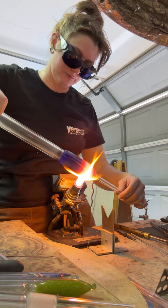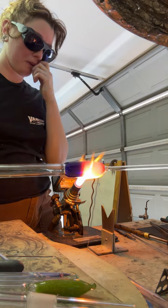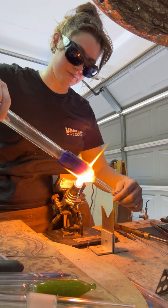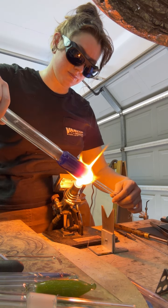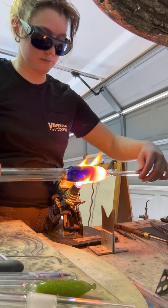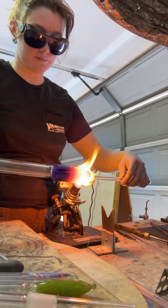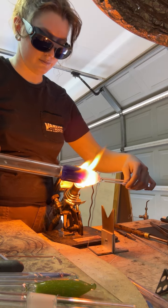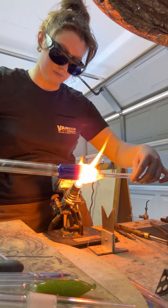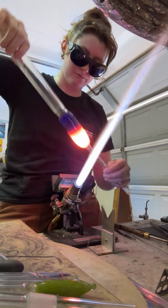I want to make sure that the section that I'm working with isn't going to be a hard 90-degree angle heat break. I want there to be a descending amount of heat into that handle, a decrescendo, if you will, of heat into that handle, because I need that thicker portion of the flare that we initially opened to once again be the size of 12mm when we are done pulling it. So it's going to be going from a flare back down to the same diameter it once was once we start pulling the shoulder of that thicker piece of tubing.